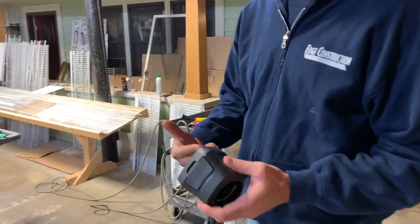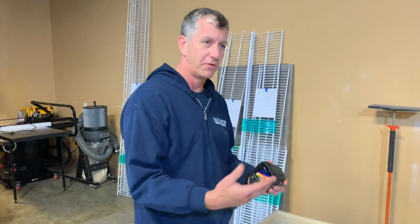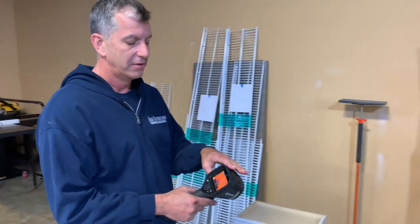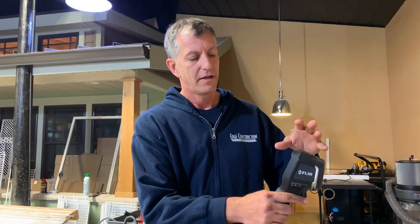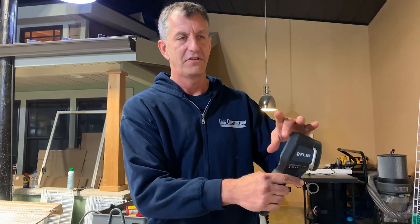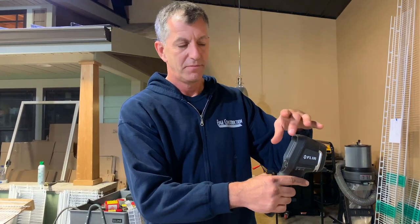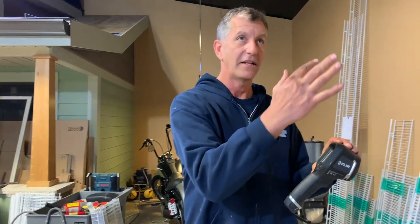Now that fall's coming, it actually gets a bit easier to use. It's when things either get really hot outside or start getting cold outside that we use this infrared camera. It takes a picture, and then it superimposes that over an infrared picture, which shows heat and cold. What we're looking for is hot spots and cold spots.